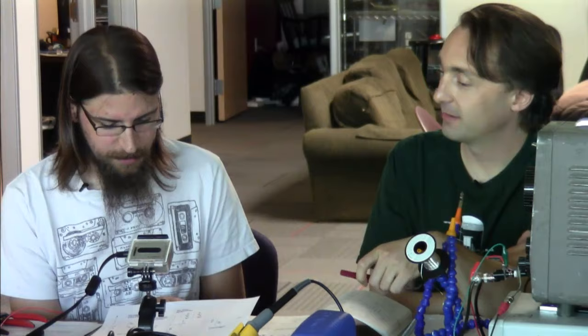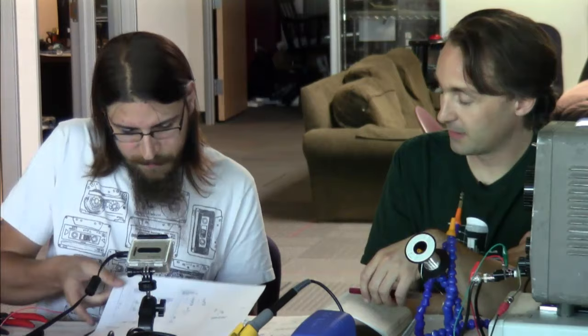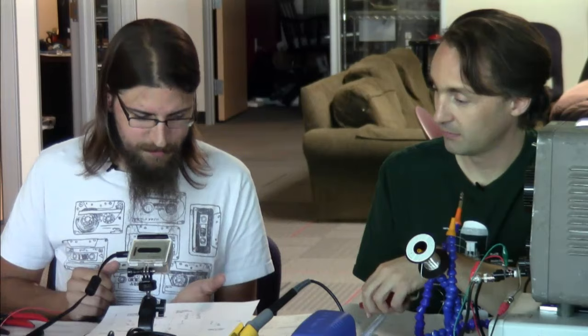So with this SPICE model, we were able to simulate what the frequency response would be and try to match it to the RIAA standard. The application note just gives us the core, which does the frequency response, and then we've added some extra components on it to make it work physically with our inputs and outputs. But I think we'll talk about that later.